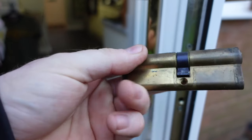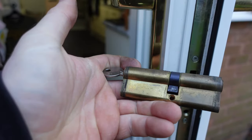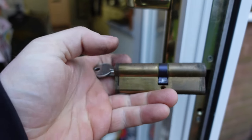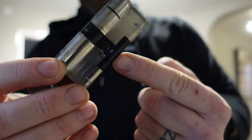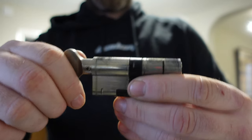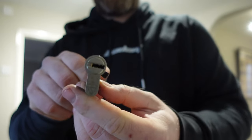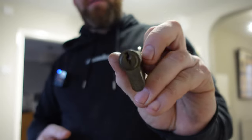I'll take it with me to measure to the centre pin because this one looks like it's going to be 60/40 or something. She'll be in all day so that's fine. The front one is near enough the same — there's still a screw holding it in but I've taken it out from the inside. Take the thumb grip off: just turn it slightly to the side, give it a pull — done. Changing these locks because this one's going a bit crappy, and I thought while I'm at it I'd swap the back one too, because these aren't anti-snap and burglars can get in within seconds without anti-snap.